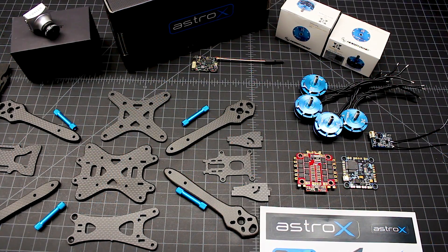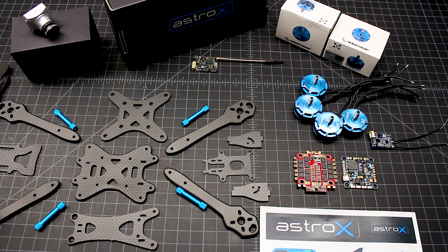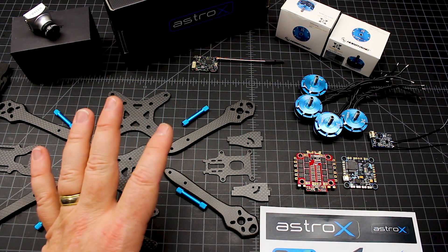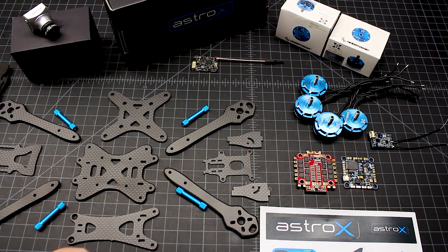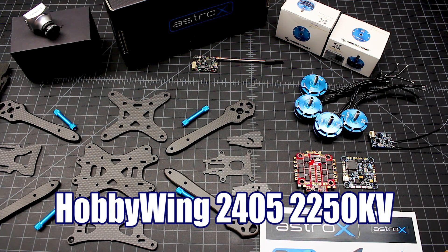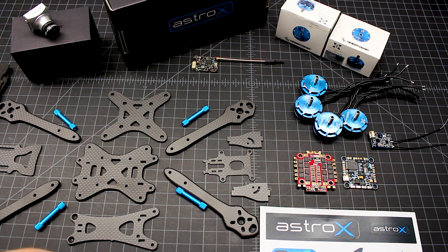Let's get right into the tabletop. We're talking about the Astro X in the stretched version. This customer came to me and said, 'I want you to build whatever you think I would want.' That might be a little daunting if I didn't know this customer so well, but I know what he likes. So we're building him power and we're going to do that with 5 and 6S builds. This is primarily built for a 5S or 6S. These 2405s from Hobbywing — you can absolutely run them on 3S, 4S, whatever you want.